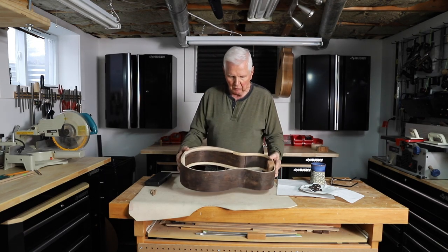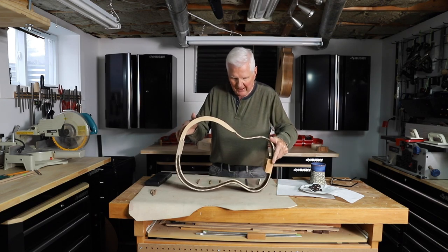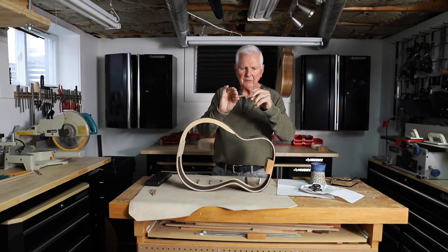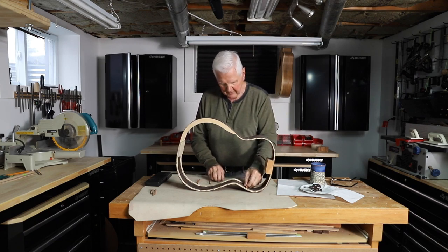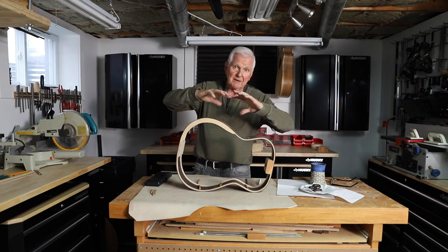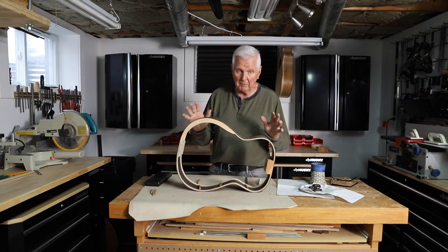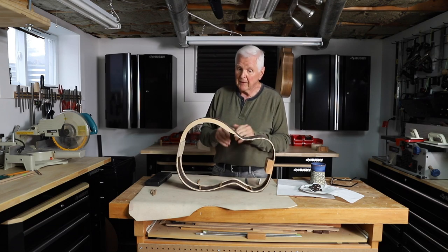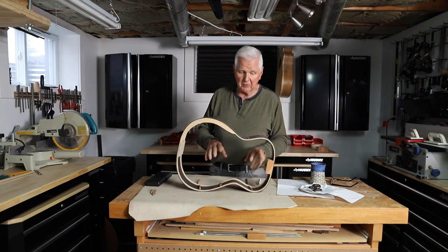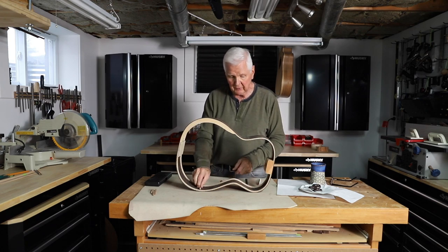This is sloped this way. I will do just a tad more before we put the top on just to make sure we've got this thing perfectly flat and straight. We've managed to get the braces done today — they're sloped and they just fit in here like this. They go into here, they go up here, and they'll get glued. That will keep this thing from twisting. It also helps with the humidity factor because humidity is our major enemy, so we've got to brace for trouble. The best way to do that is brace it properly. We'll have braces going up on the top as well. I'll get those glued in for the next video.